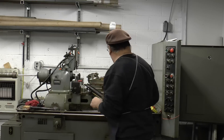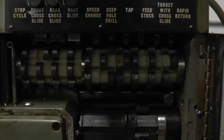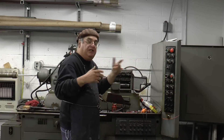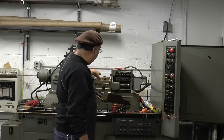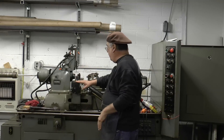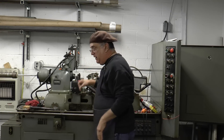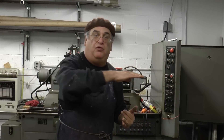The way this works — I'll get a close up — this is a programming unit and there are microswitches above here. When these little lobes come up in contact with those microswitches, it opens up relays and does things. When you're running, you can hear them kicking in and out, and it allows the turret to go back and forth. Everything runs off this turret: the cross slides — there's an independent forward slide, independent rear slide, and an independent vertical slide with a part chute. It changes speeds, reverses, taps, deep drills and pecks.